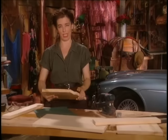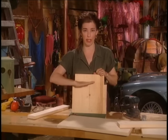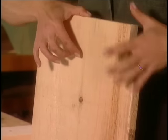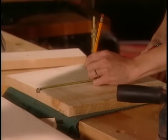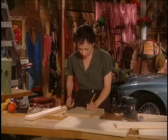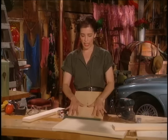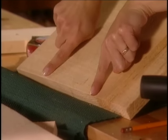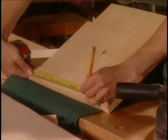Now it's time to talk about the V. This is the rule: don't start the apex of the V any higher than halfway up the board of your side piece. Otherwise the board can end up splitting because there's just not enough material there if your V starts way up high. So I'll pick a point that's halfway — that's at the six-inch mark. I have to find the center; since it's a nice 12 by 12 inch board, it's pretty easy. There's another proportional rule: the two legs shouldn't be less than a quarter the width of the board, so about three inches because that's a quarter of 12 inches.